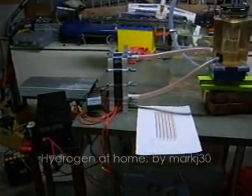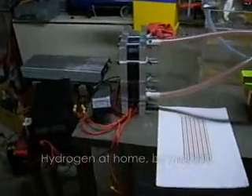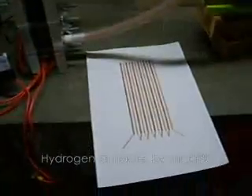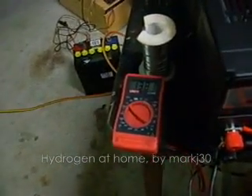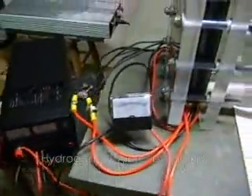This right now is set up with 12 plates. I'll show you the diagram in a sec and talk you through it. But first things first, let me flick it on and get it going. Right now it's set up at 13.8 volts and it's a bit over 5 amps — that'll creep up.